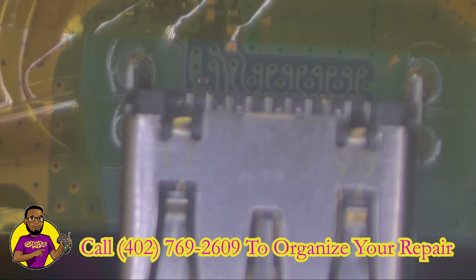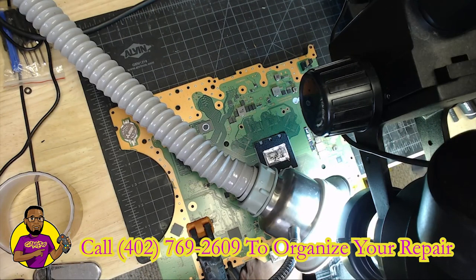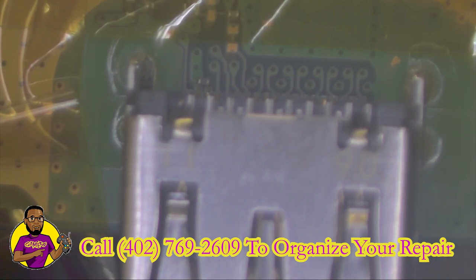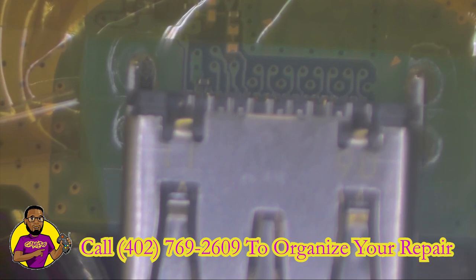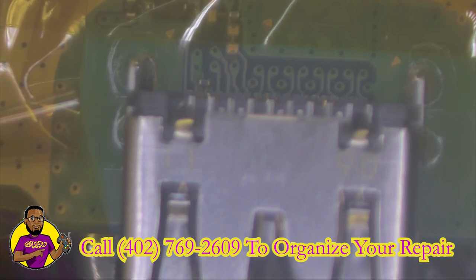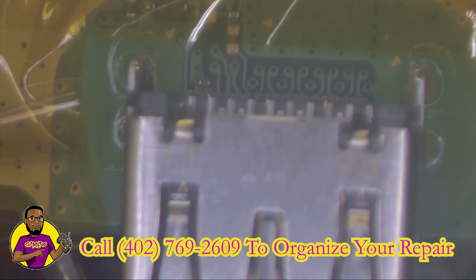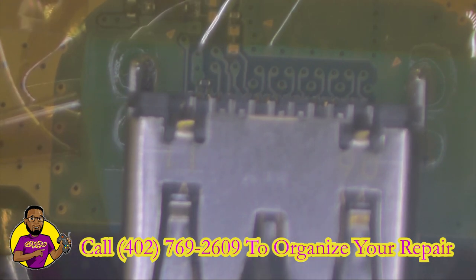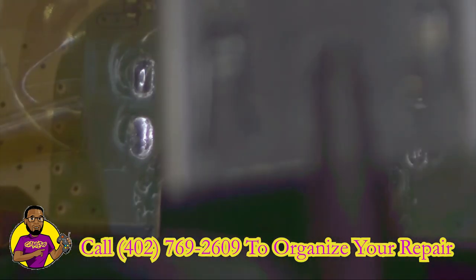I have my heat gun on and running. I have the fume extractor right next to it. As you can see from the microscope, I have my heat gun next to it — I'll show you how my setup looks from right here. It's going to take just a little bit to heat up this HDMI port to get it off. At the same time, I also have my solder iron heating up, getting ready for this HDMI port to be lifted. As soon as we get this off, I'm going to put down some flux on the header and we're going to re-solder all the pads.